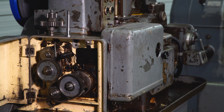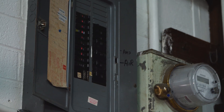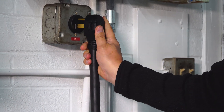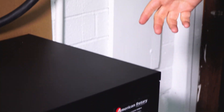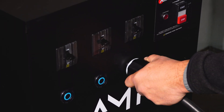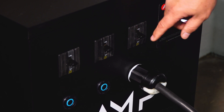Let's get everything turned on. Mr. Amp showed up in the house and now we've got three phase, so let's see what this looks like when we're running. This is circuit 15 and it says amp right here, so this was probably the easiest preparation for three phase ever. We had to change this receptacle so that the amp would plug in. With all the switches off we have a 30 and two 20 amp breakers — plenty for all of our equipment. Now start it up and then you can energize your equipment.